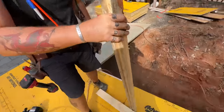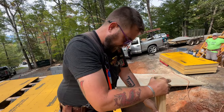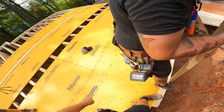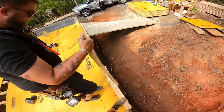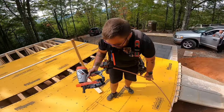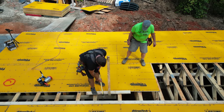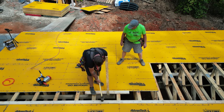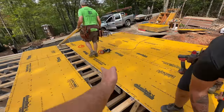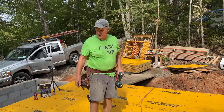Beater block 2.0, maybe. So you can stand there, it means you'll have to swing the sledge one-handed. Or someone else can swing the sledge. Two boards screwed together — brilliant. It's actually brilliant. After the 20th house, I've done it again. Arlo's removing our board that we had for layout for these trusses. Now that we have our sheet up and it's nailed, it's keeping it on layout and we'll continue to work our way down like that.